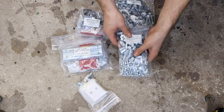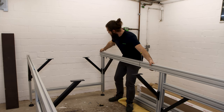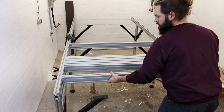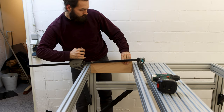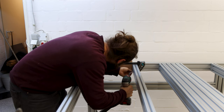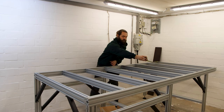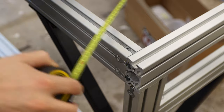Since the 4896 is over 2.5 meters long, the horizontals are out of 2 connected parts. Then I inserted the cross members of the bed, and to space them right, I had 2 pieces of ply cut to the appropriate length. With a trigger clamp, I held them in place while screwing them tight. This way, I worked my way to the end. To check the bed for square, I measured the diagonals, and miraculously, it was already dead on.